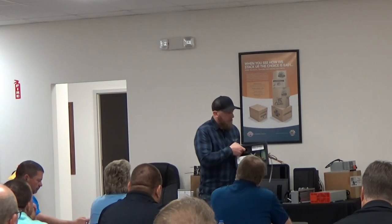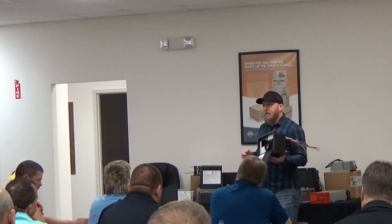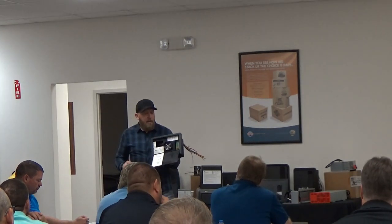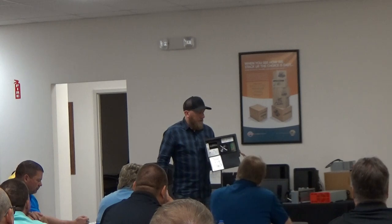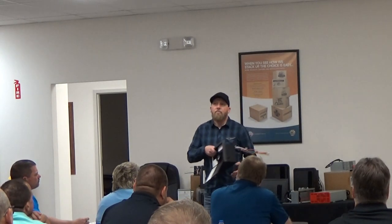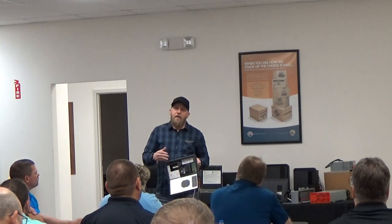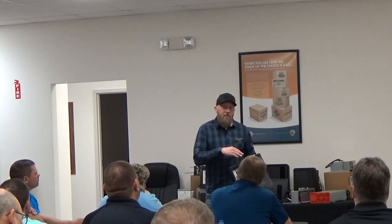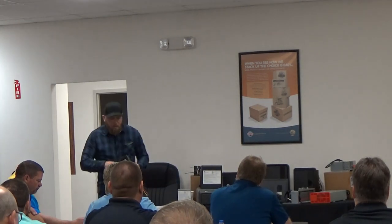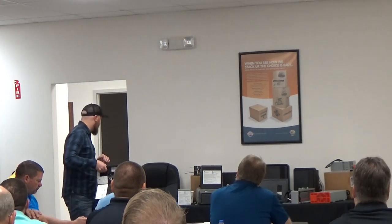So if they have a battery connected to the system, the battery is a load itself, and a lot of times it's the battery charging. Or if they say nothing's been on for a couple days and the battery is still pulling the fan on, usually that will indicate a weaker or dead cell in the battery itself. A weaker dead cell in the battery can actually prolong the fan from running because it thinks it needs to keep charging and might cycle a little bit. So the battery is a load, and the battery can make the fan run as well. The battery's taking from the converter.